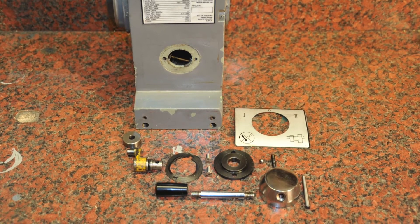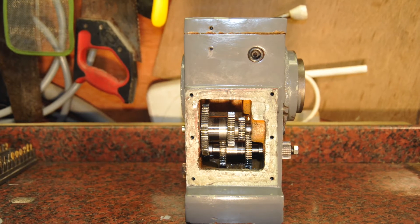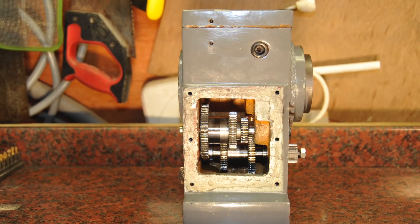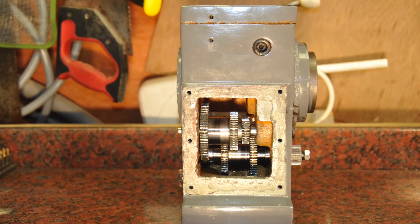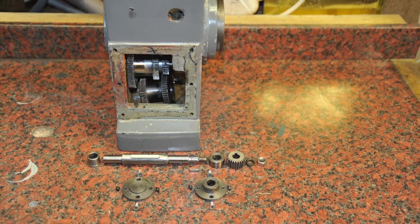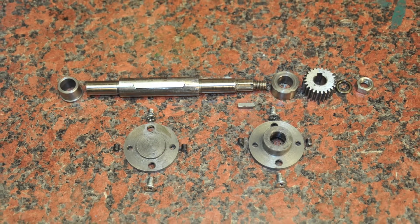The plan is to strip out everything from the headstock because I'm going to machine the back surface of it. This is the high-low gear selector with the ball detent and linkage — it slides paired gears on a splined shaft. It's low rotation speed stuff so it's just machined bearings. The finish of my machine was pretty good with just a few ragged edges and burrs, which are honed off before reinstall.